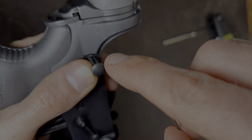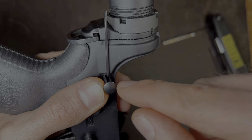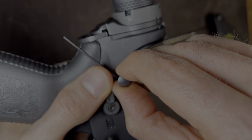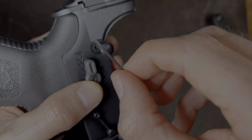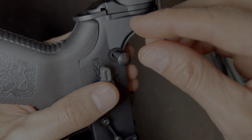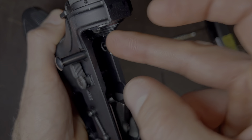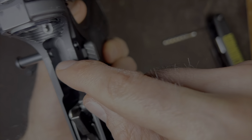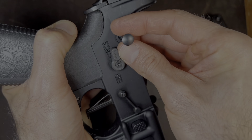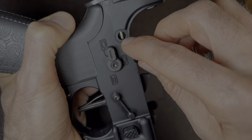Take the detent tool, put it in with the angled part going towards the detent. Put your thumb here so the pin doesn't go forward with the tool. All you're going to do is push the tool towards the detent and see how it slipped underneath the detent. Now we're going to turn the pin. This channel right here was facing this way — once I got the tool underneath the detent, I was able to spin the pin counterclockwise and now the detent is captured in here and not in this channel anymore. So now we can remove the pin completely. I put my finger inside here over this hole right where the pin is, so the detent doesn't come flying out to the right. Remove the pin slowly — the detent is captured just like that.